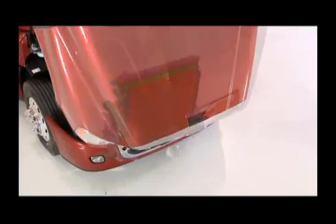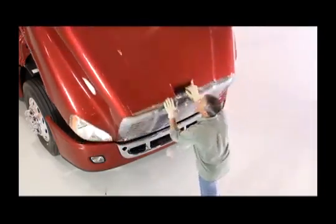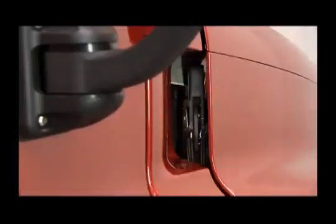When you're ready to close the hood, a closing assist spring helps you overcome the initial resistance. An oil-dampened closing mechanism prevents the hood from slamming down, for example in conditions such as high winds. Once the hood is moved to the point where the weight takes over and pulls the hood shut, the spring takes effect, and it will take approximately 5 seconds for the hood to close. Do not try to force the hood down.